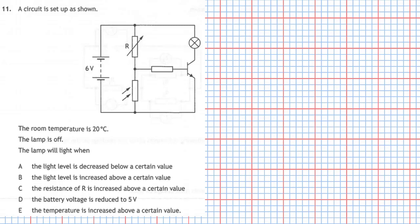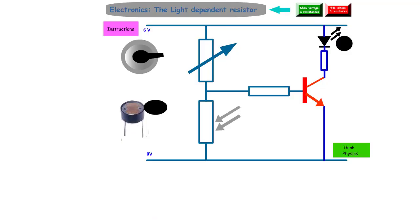We need to decide whether it comes on when light level decreases or increases. To help understand this, I'm going to take you to a simulation — a similar circuit, but with an LED instead of a lamp. In the simulation, the LDR is in the bottom half of the input chain and the variable resistor is on top. The LDR is uncovered, meaning it's in the light, and the LED is not on.